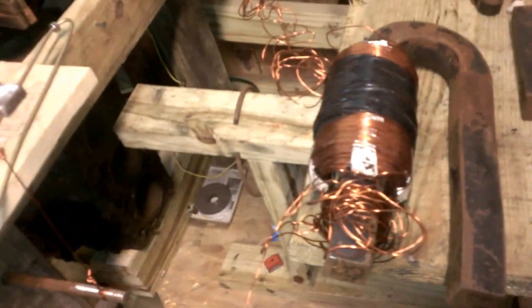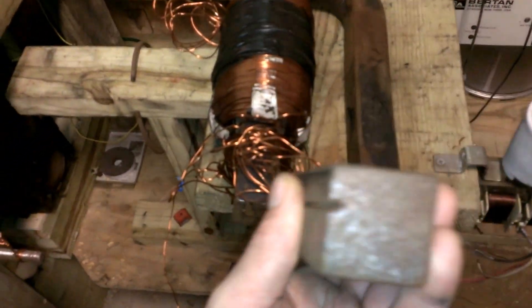What we have here is inch and a half stock of soft iron — too heavy, even a stick falls right off. We have a little beat-up coil, front and back, a lot of experiments, but 16 gauge, 1500 turns. What we got here is positive and negative coming off a 12-volt battery, and I'm going to go ahead and connect positive to one end of this coil.